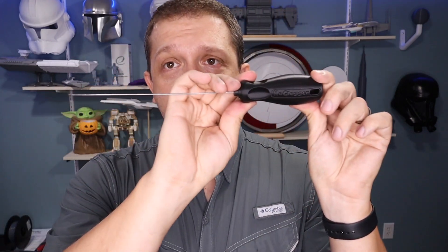The other use for this tool — you know all those nozzles I just pulled off and disregarded? A pair of pliers, a heat gun, and this — nozzle's cleaned. This tool is extremely functional for your shop. If you're doing filament printing, it runs about $19 and it is fantastic. I have now recycled more nozzles than I'm throwing away because of this. With a 15-minute sit-down session, poke through each nozzle and they're cleaned out and ready for reuse. Sometimes they're not going to work perfectly, but nozzles are cheap.